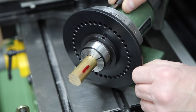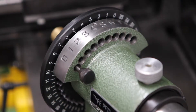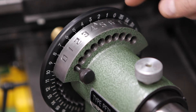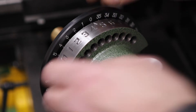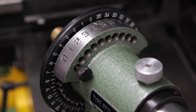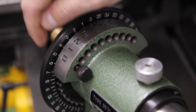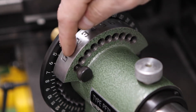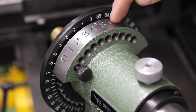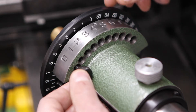Most notably I've got a couple of projects coming up that require measuring dials, so I want to be able to accurately cut those measuring marks into those dials using this device. The dividing plate itself is marked out in 10 degree divisions from 0 all the way through to 350 degrees and back to 0 again for 360, in 10 degree divisions - so 10, 20, 30, 40, 50 and so on. On the device itself we've got 0 through 9, which represents the degree divisions between the units of 10.